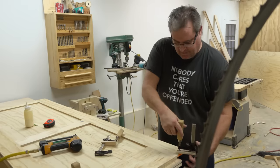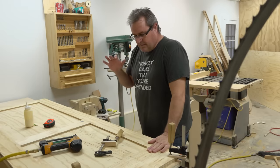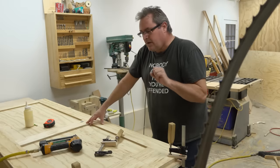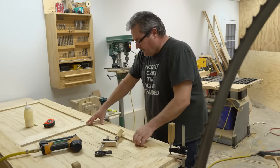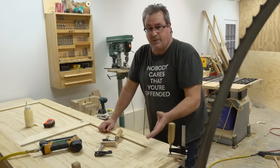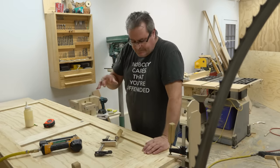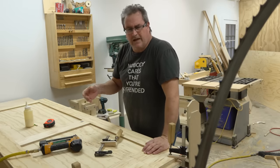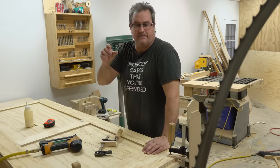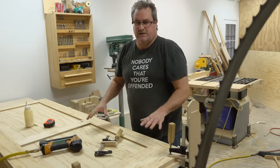I've got two more clamps and I'll clamp it down to the plywood on this side. There's one other thing I can do at this point — add the trim to the inside panels. One option is to just leave it and sand the plywood well enough to paint it. But I think I want something a little different. Last door I made like this had an OG molding, but this one I want a more modern look — a bit of a reveal with block trim, something half-inch square that gives a little more dimension and definition.